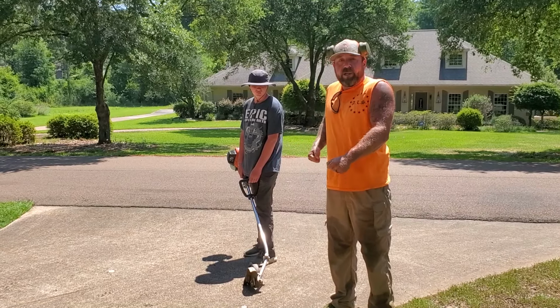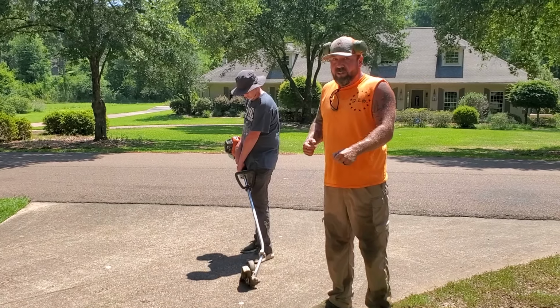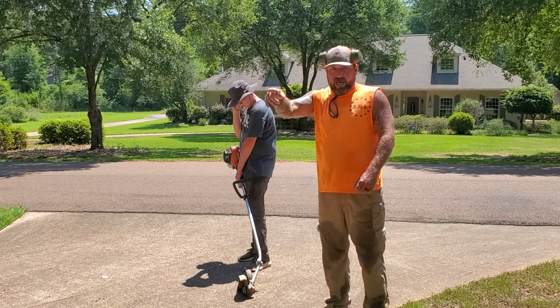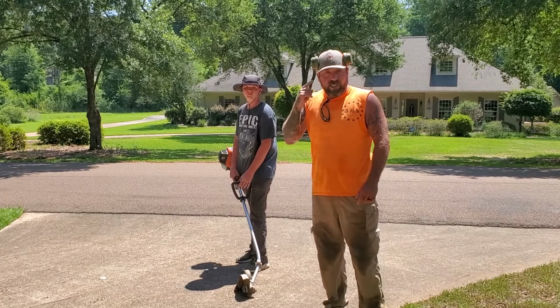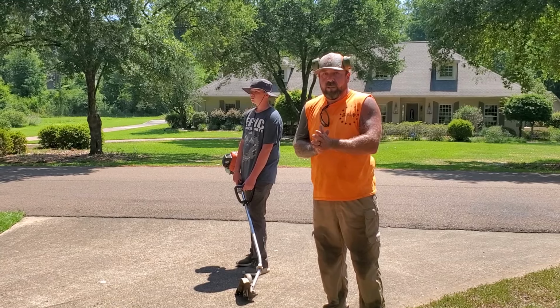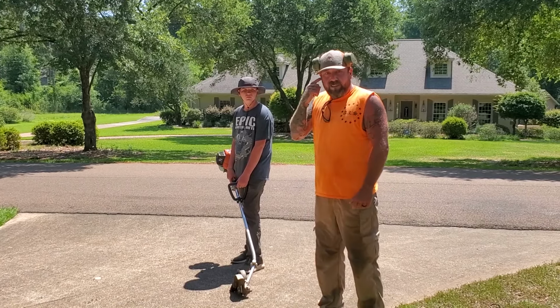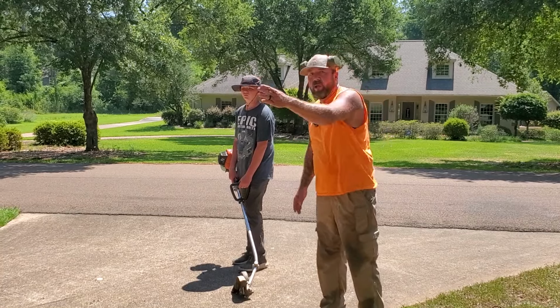He kept his body rigid so the edger couldn't move unless he let it move. And then he listened, which is what I was telling him coming down here. Keep listening for the blade to just barely be touching the concrete. He kept it at a steady angle. He listened for that blade. First time ever, perfect edge.